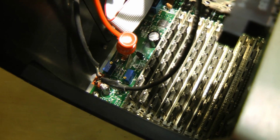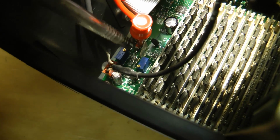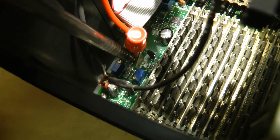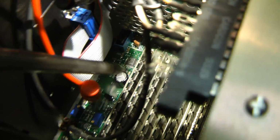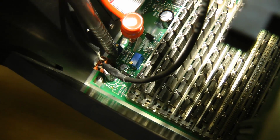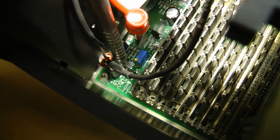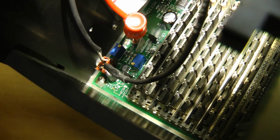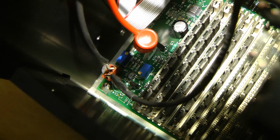Okay, I think I've narrowed this down a bit. After injecting a signal into the input from the CCD amp, I didn't see anything on the input of the video ADC over here. The signal seems to go through this 8818 op amp, which appears to be operating improperly. The positive input is higher than or lower than the negative input, but the output is still high.